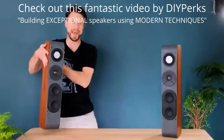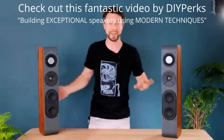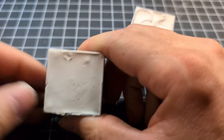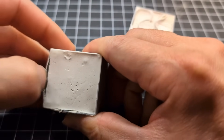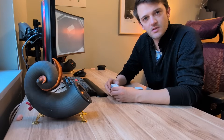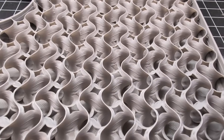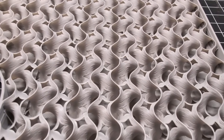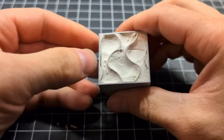Taking inspiration from others who have made large DIY speakers, I opted to use plaster of Paris, which is cost-effective, readily available, and is a great rigid wall filling for the enclosure. I was initially concerned about a double shell wall design delaminating due to the size of the enclosure. My proposed improvement involved using the unique continuous volume property of gyroid infill, intending to fill that internal structure with plaster to create some sort of plaster-plastic matrix.